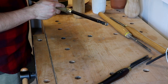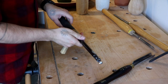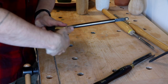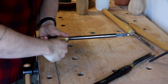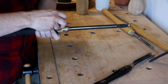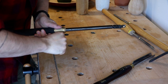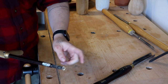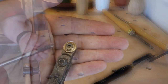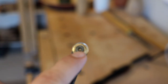And then there's a Crown Tools hollowing system — I can't remember the name exactly. That's the tool I use for hollowing on the end grain. You can extend it by removing the handle and putting it on the end, but I always use it as is for more support. There are some different bits you can put on — this is the cutting tool, the ring tool — and you can get some different scrapers. This one is pretty aggressive. You can change how thick the shavings are by adjusting this screw down here.